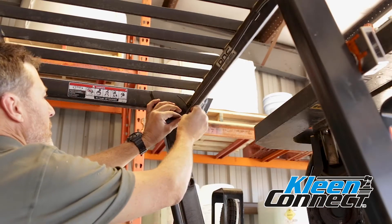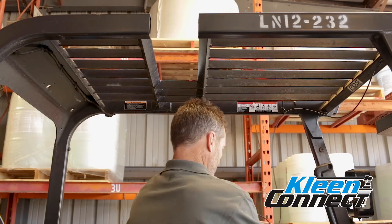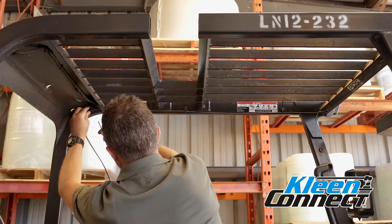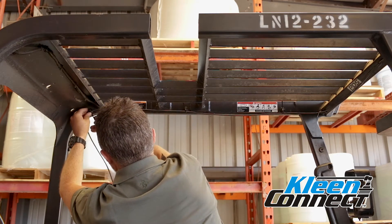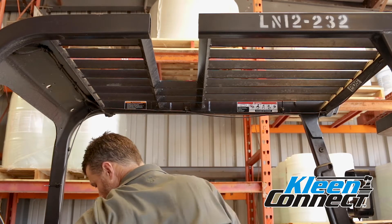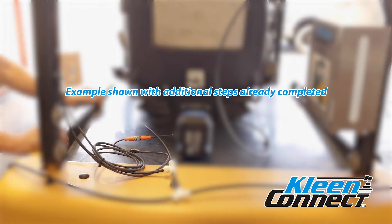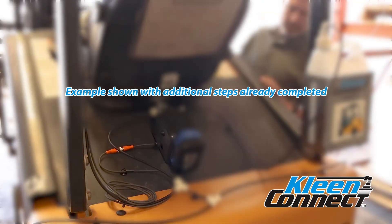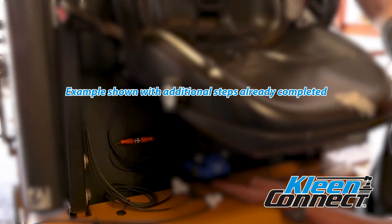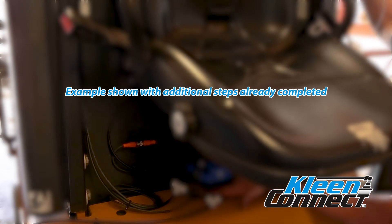Use the plastic ties and small magnets to secure the cable but do not pull the ties up snug. Leave enough area to route the chemical tubing inside these ties. Once you have routed the cable back to the pumping module, coil up the remaining cable and use one or two of the plastic ties and magnets to position the remaining cable in a location that will prevent damage when the forklift seat or cover is lifted. Attach one end of the cable to the matching pigtail on the pumping unit and adjust the coiled cable as needed after connection.